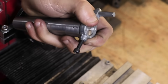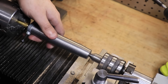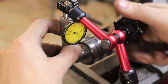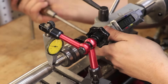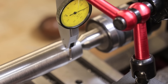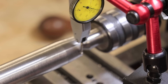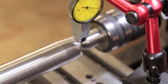To finish the taper I'm going to set up the part between centers, and by offsetting the tail stock I can then cut a taper. A five degree taper is definitely a lot for this method, but it should work. I'm able to use the taper which I cut before to sweep using a dial indicator, and that will allow me to dial in the correct amount of offset in the tail stock — I'm looking for no movement in the indicator, meaning the lathe will be cutting that exact taper. If you had two dial indicators, you could skip this and use trig to calculate the required offset, but I'm using this method instead.